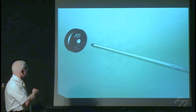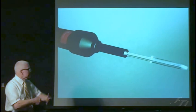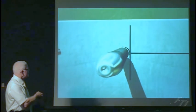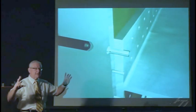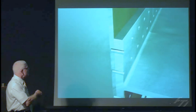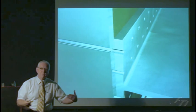We have the expansion mandrel, which is periodically checked for wear, and it's attached to a hydraulic puller unit. A nose cap reacts the load and keeps the sleeve in place. The lubricated sleeve is placed on the mandrel and inserted into the hole from one side. As we pull the expansion portion through the sleeve, we locally yield that material. After the mandrel goes through the hole, the material further away — still elastic — springs back, leaving the area around the hole in a state of compression. We then verify the hole is cold expanded, remove the sleeve (used only once), and size the hole for the fastener to be installed. If it's going to be left as a drain hole, that final sizing step can be eliminated.